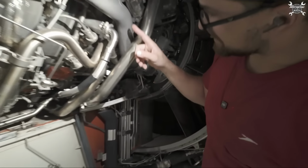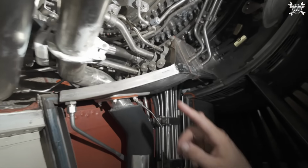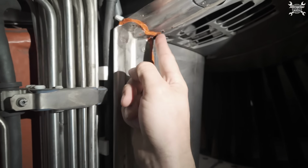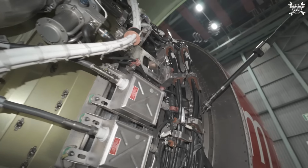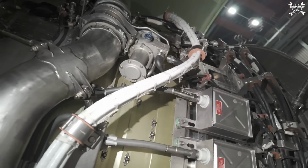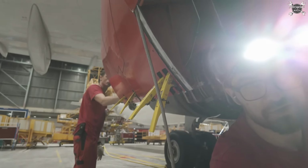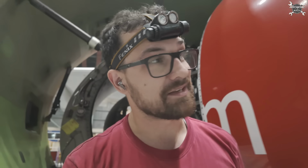Okay, the job is done. The igniter lead is installed on the igniter plug. It is all the way secured, all the way to the junction box. Then this lead behind this cover, as you can see, the sealant is already tack free. Then it continues all the way there, and we tied it on the ignition unit. Duplicate inspection has been performed by my colleague over there. And basically, that's all about the ignition lead.